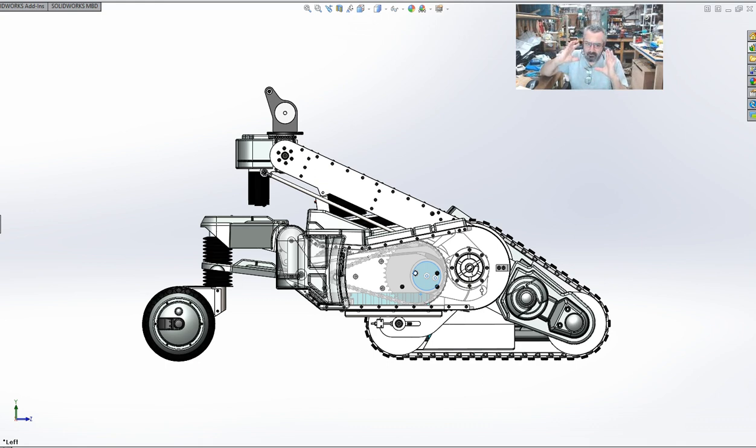I've tried to make this as much of a retrofit as possible. So some holes that you have in your cradle base sides you won't use, and you'll have to add some holes in your cradle base sides, things of that nature. G plates: if you already have a hole in there, you're going to have to add an additional hole. I'll try to remember to cover all these things.